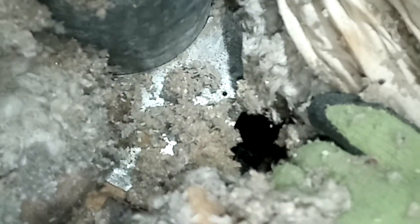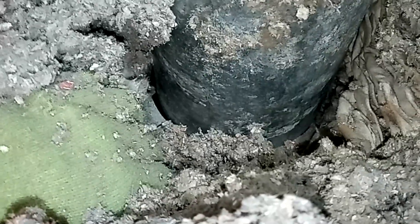If you have moisture and you're worried about that, it means you haven't air sealed and vapor-barriered your ceiling properly. You should be vapor-barriering and air-sealing your attic floor first so that you don't have that problem. The biggest thing is if you've got an old furnace exhaust or hot water heater tank exhaust, you want to air-seal right around that using a spray foam canister or even some HVAC aluminum tape that you can purchase. Depending on the fire code, you definitely want to check that out to make sure what you're installing is heat-rated.